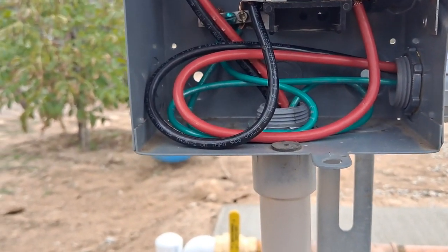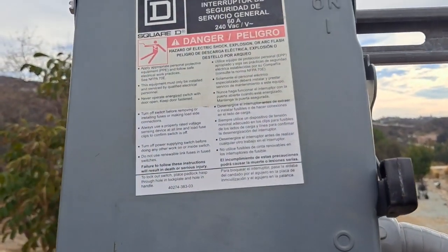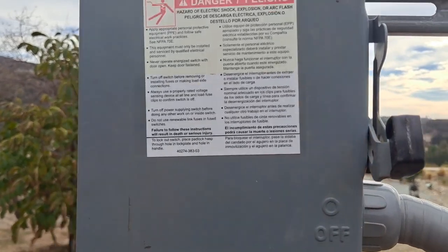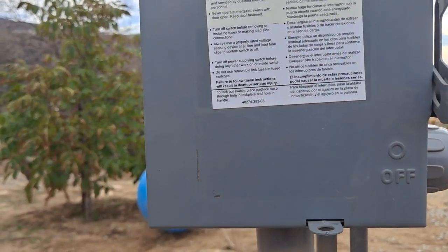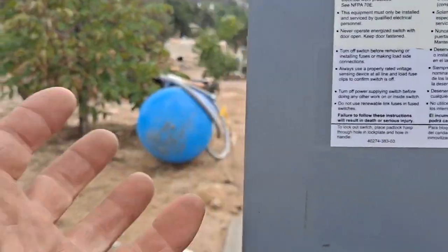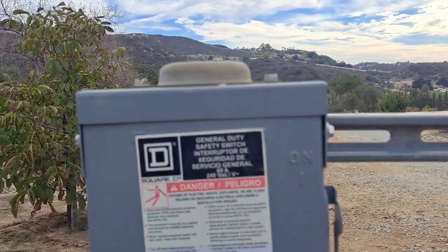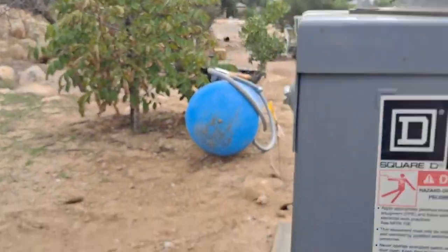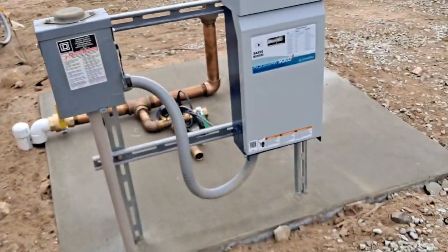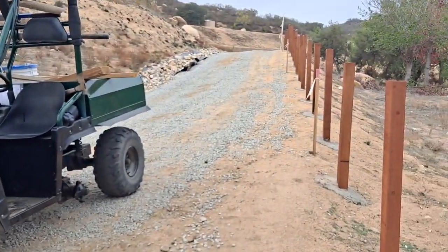If I wanted to have an outlet, or usable power for 110 or 120 or whatever, I would have needed to bring in neutral. So I won't put an outlet here, but it wasn't really that big of a thing to me because I have an outlet not all that far away. It wasn't worth having to add another wire. Although the pull was kind of a pain just because of the length.